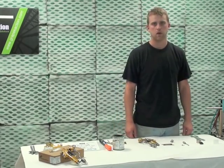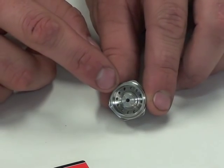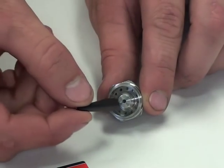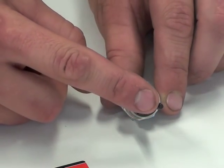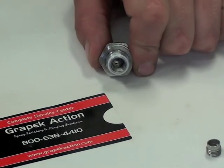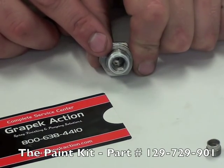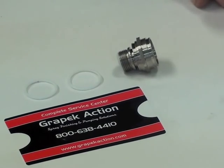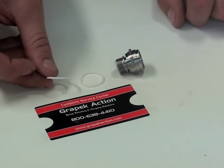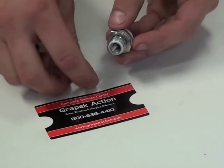Now I'll show you how to put together your seat holder assembly. There are several seals that go on. The first sits in the groove, part number 129729912 — one comes in the kit, and the kit includes a tool to slide the o-ring all the way back into the groove. The second seal is part number 129729913, which also comes in the paint kit. The next two seals are both part number 150-040329: one goes on the front and slides into the groove, and the other goes on the bottom.